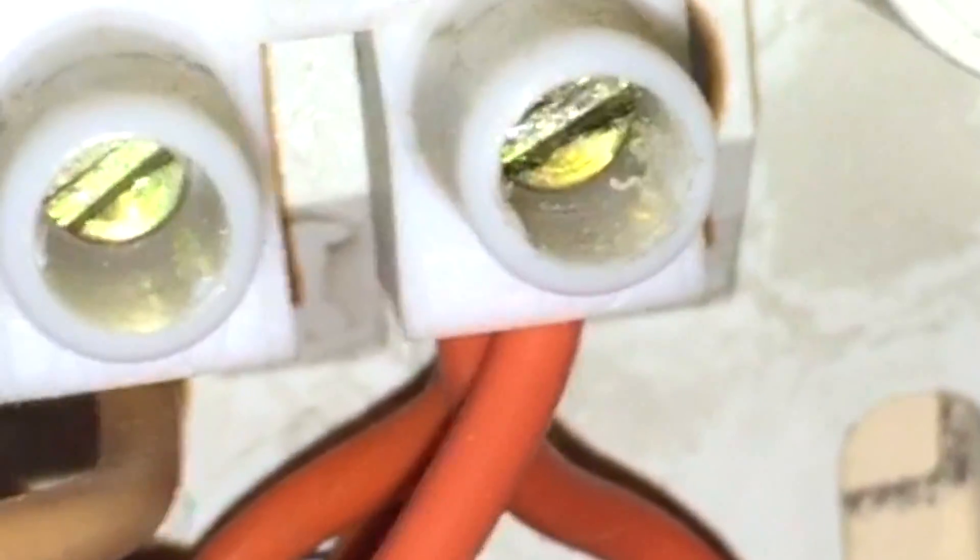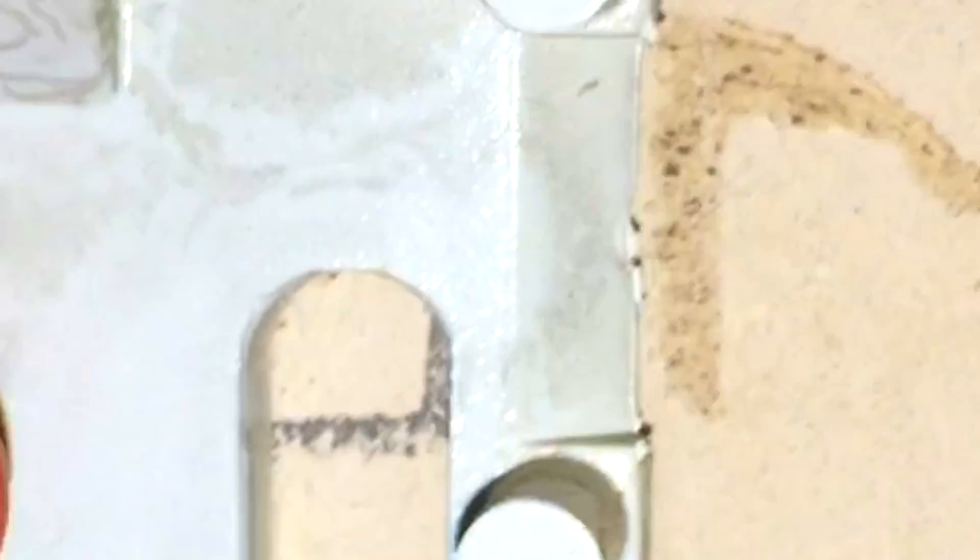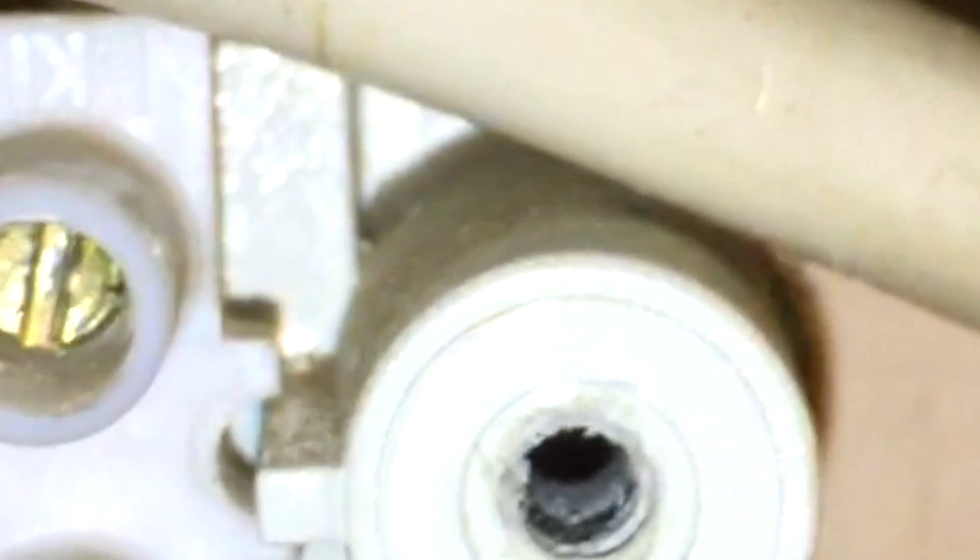These two appear to be okay. Here's the wiring centre. I'm going to find out now what's causing the boiler to run — it's obviously one of these valves giving power. As you can see, they're all wired in there, and all four oranges go in there. So the top of that must be the switch live to the boiler, and it goes into that black cable that runs up.